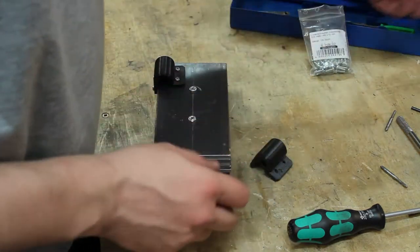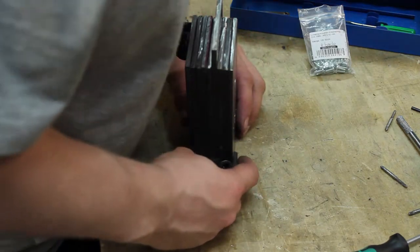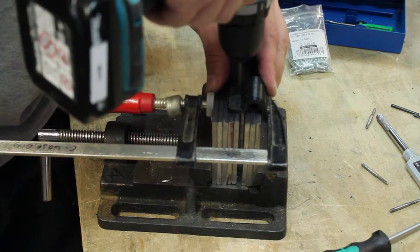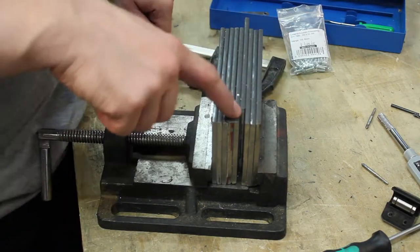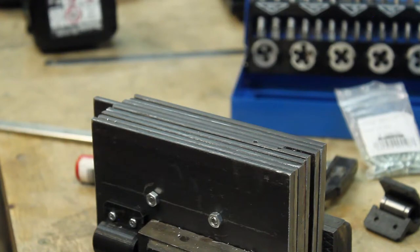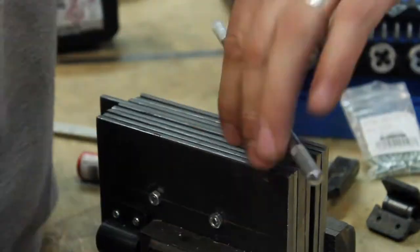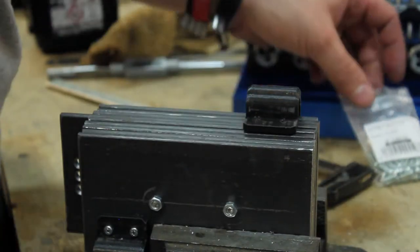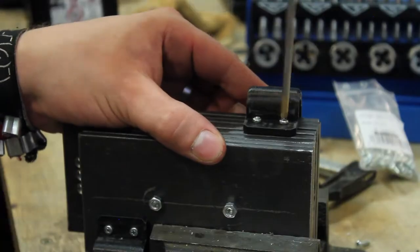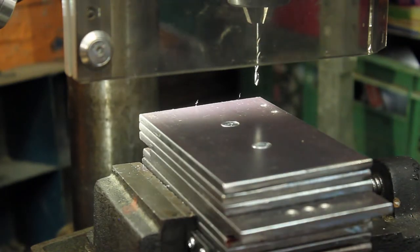Let's continue with the other linear bearing, which goes on that corner in this position. Let's check the plan — yeah, this position, like this. Two clear divots. Let's drill the 2.5mm hole and then tap the thread. Let's do another time-lapse of tapping two M3 holes. Let's try if this fits, and then when this is fixed in place I can pre-drill the other side. Now I'll drill the 2.5mm of the last two holes — let's hope not to break the drill bit. And then this counterweight thing is done.